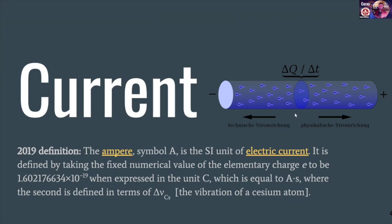And if you're ever trying to light up an LED, typically an LED, the ones that we're going to handle on a regular basis, they're almost all specified for about 20 milliamps of current, which is a current rating. It's a small amount of current. High amounts of current would be like a vacuum cleaner draws 6 amps. And so that would be somewhere in the ballpark of maybe 300 times as much current as the LED. So vacuum cleaners take lots and lots of current. Our little LEDs that we'll be playing with take very small amounts of current.